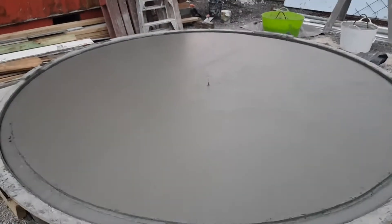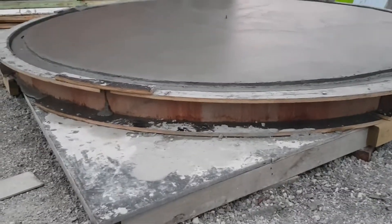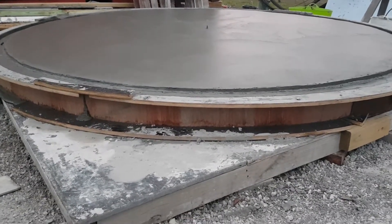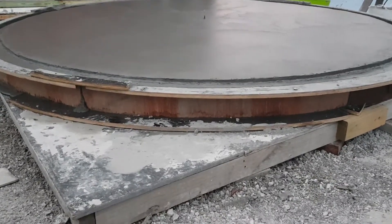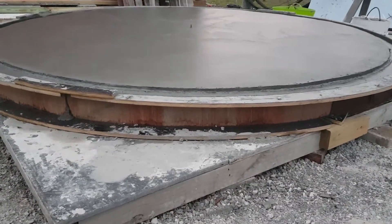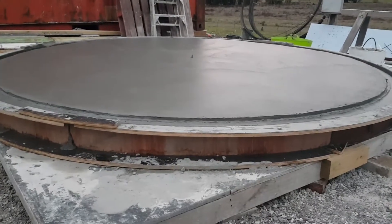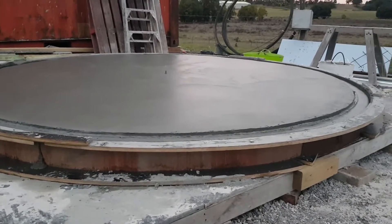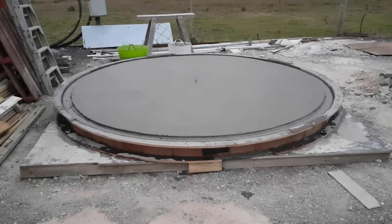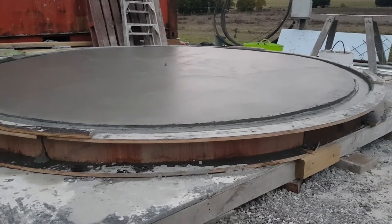That centre point also ensures we have a consistent radius around the slab former when we set it up. This slab is 150mm thick, it's got two layers of F82 steel, and it has a rebate around the top. We've put that in because this dome is going to be under vacuum inside — that channel also creates some extra resistance to the suction. We'll be going around that channel drilling and chem-setting starters, and we have quite a few holes to drill in there.